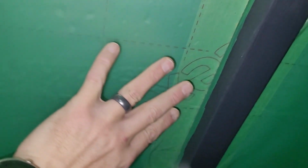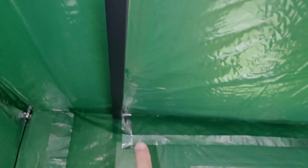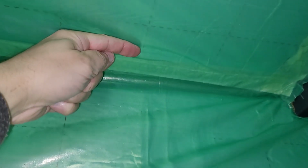And then with the ceiling, because I put the 25 mil PIR on top of the 4x2s that were running down there and across there, and then obviously one across the middle, I then couldn't staple this to it. So what I had to do is run double-sided tape, literally all the way across there, and then all the way back down this side, and then cut out a section of this Vapour Barrier to fit here. As I say, double-sided sticky tape there, so any moisture potentially is going to track this way and round, and then straight down the wall basically.